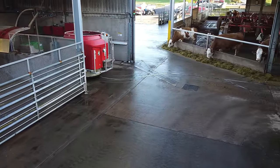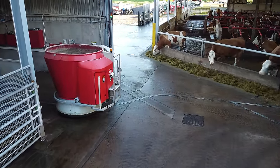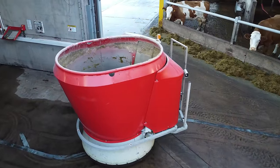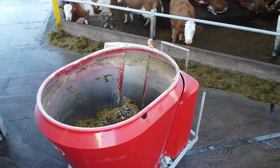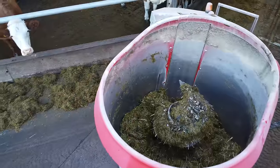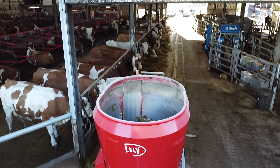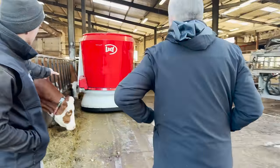The vector is moving off to feed now. On route one with the milking cows, it goes every 40 minutes. If it's not feeding, it's doing what we call a scan — checking the height of the silage. If it goes below the desired height, it knows fence one or fence two needs more and tops it up. When it's full, it'll go to whichever fence needs feeding and dish out the silage just like a normal diet feeder, while simultaneously scanning the other fences. It's never really doing an empty route, and it checks the dry cows' silage on the far side too.